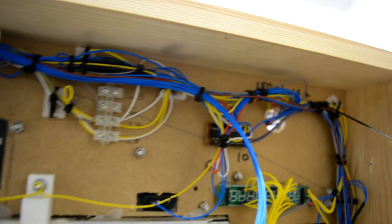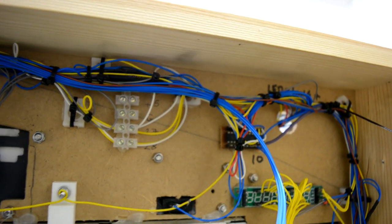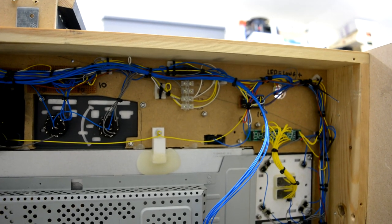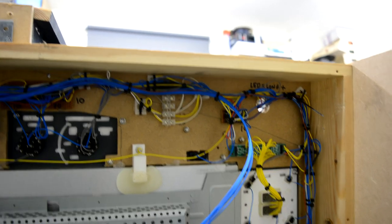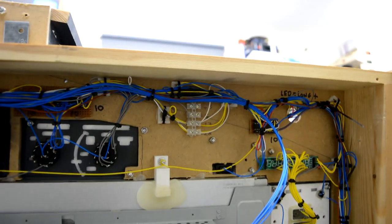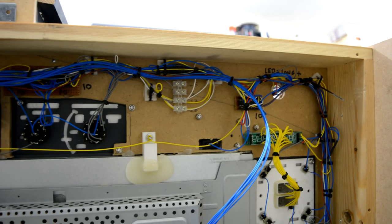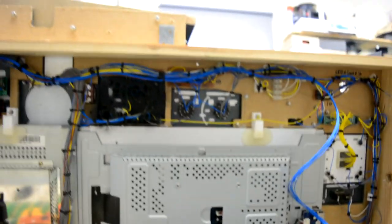As it happens, I have 8 pins free on this board, and we need six for the six pack and one for the master caution and one for the fire warning, so that's eight in total. So we will end up filling that final board, and that is the last LEDs I've got to fit to the MIP. So all LEDs on the MIP are being controlled by one pin on the Arduino.